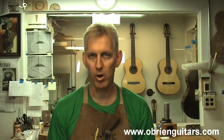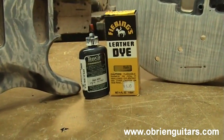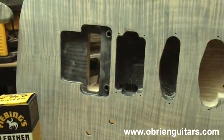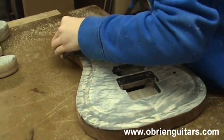For a sunburst type finish, where I want to pop the grain and accentuate it and show it off, I start by painting the guitar with a black dye. This dye could be alcohol soluble or water soluble. The difference is that alcohol flashes off quickly, so the dye doesn't penetrate as deeply into the wood. A water soluble dye will penetrate deeper. Once I've painted the surface with the black dye, I let it dry and then sand it — not all the way off, because it goes pretty deep, especially with the water-based dye. I just want to pop the grain.